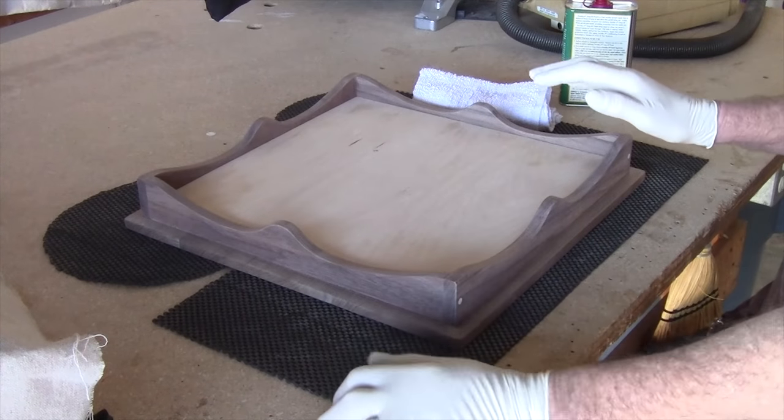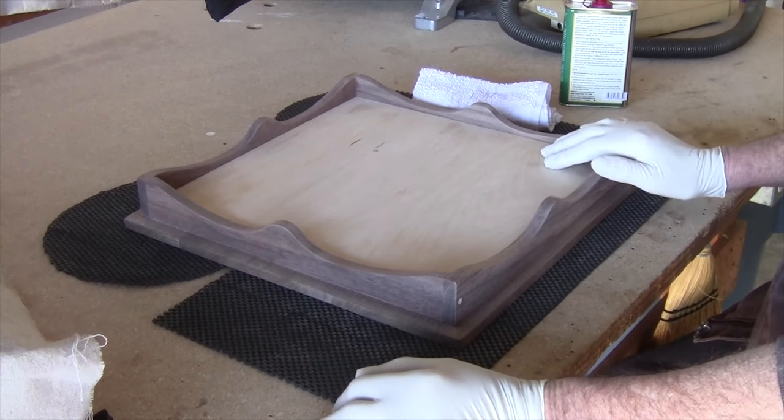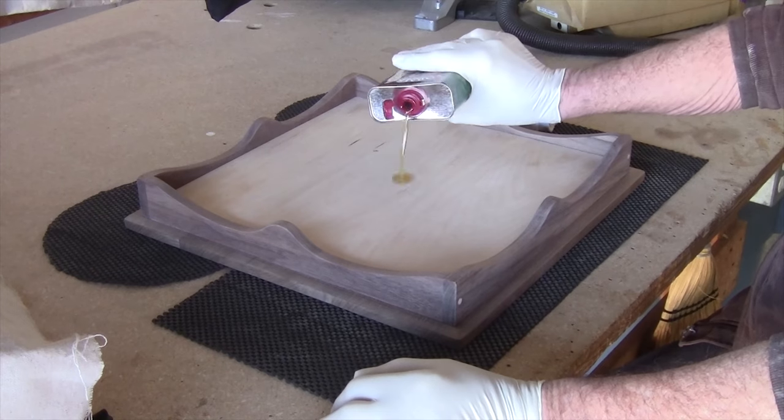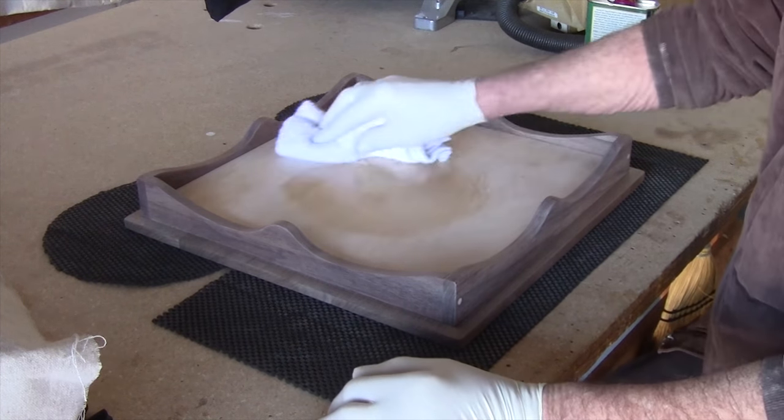Okay, now it's all been re-sanded with a 400. I blew it off with the air compressor, wiped it down real clean. Next thing I'm gonna do is we're gonna put tung oil on this. Okay, we're gonna rub it in like we do a wax. I'm doing the bottom first